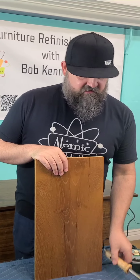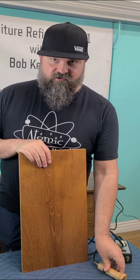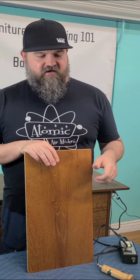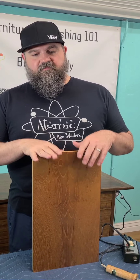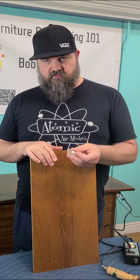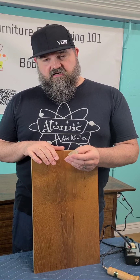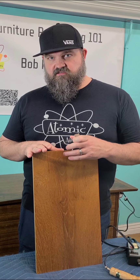What a burn-in is — you have a burn-in knife, which is electric. If you're really old-school you have one that you heat up with a flame, but I like the electric ones. What you do is melt hard shellac or acrylic material inside of your damaged area on finished wood.